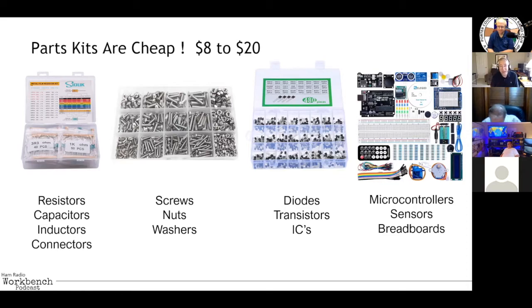So anybody that says, I know how to do this, 7805, no, they don't know what they're talking about. That is a bad idea, unless it's only running like one LED, fine. Anything more substantial than that, forget it. So what are you going to do? How about a switching regulator?